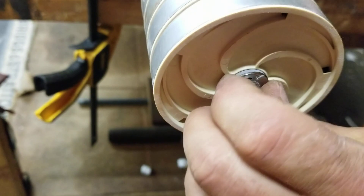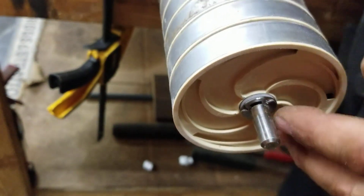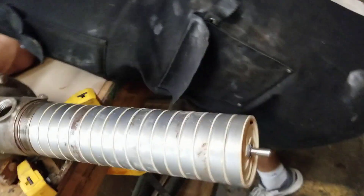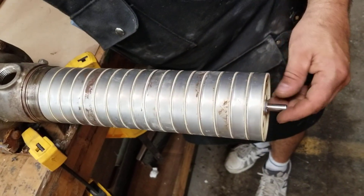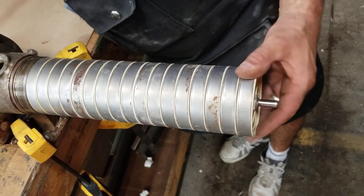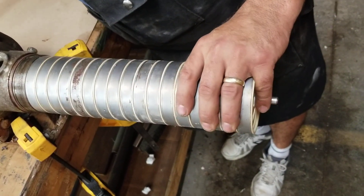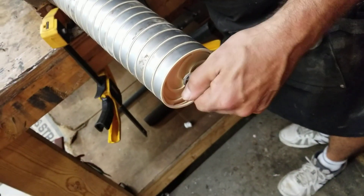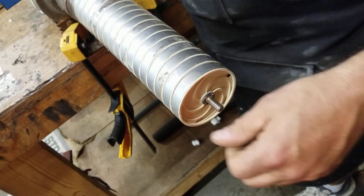You can see that has been popped into the groove. Now if I put the screwdriver in the end here so I can turn it, you can see that the impellers will turn independent of the bowls and the diffusers — they're designed to actually spin within there. Some of these may spin just because of friction, but that is designed to go like that.